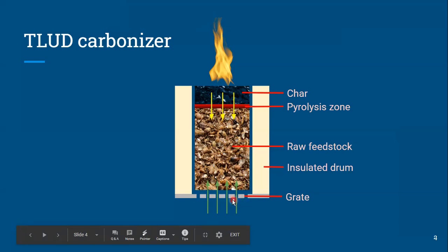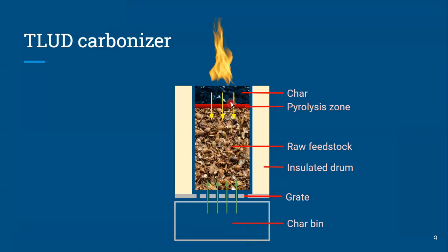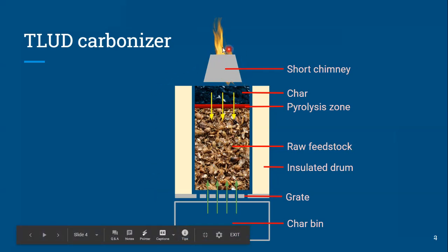You may also get excess air that mixes with the pyrolysis gases, which then makes a flame at the top of the kiln. But you don't need very much air. At KGC, the grate holes are very small, and they found that adding a bin on the bottom limits the air even further — just small cracks around the bin are enough. We don't want too much air because then we'll over-fire the char and it'll end up with too much ash. A short chimney on top helps pull in a little more airflow, especially to generate that flame. It doesn't need to be a tight-fitting chimney — it's actually better if it has a gap, so it sucks in air that mixes with the gases and ignites inside the chimney.